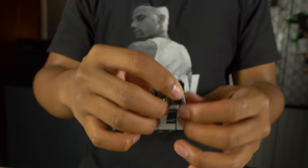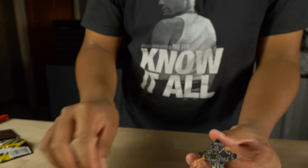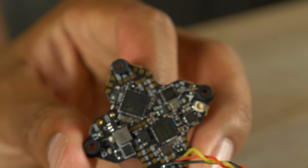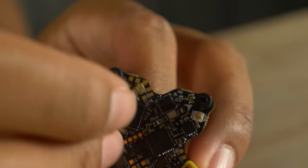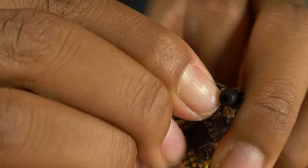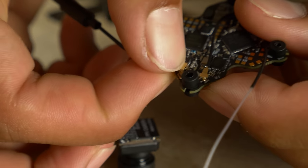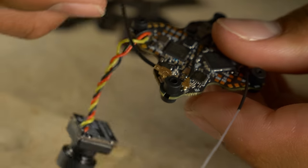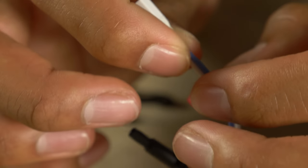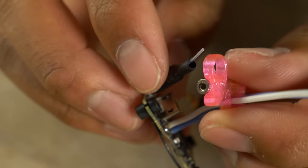Take the antennas — receiver antenna and VTX antenna — and connect them to the flight controller. You'll see the little arrow on the bottom; the left side of the arrow is for the receiver antenna. It's a bit fiddly — use your fingernail to push the UFL connector down. Plug the VTX antenna on the other connector. Face both antennas toward the back. Slide the 3D print a bit more forward on the pigtail and feed the VTX antenna through the big hole.